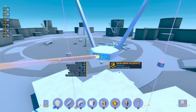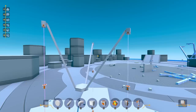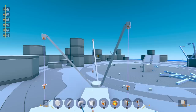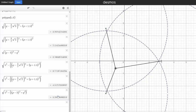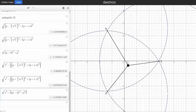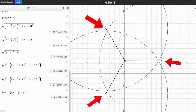Once I saw that working, I knew I was ready to add on the other arms, and after getting all three attached, I moved each of them up and down in a sine wave pattern. The way I set it up ended up moving the printhead in a circle-like pattern. To actually get the printer to print at a specific coordinate, I was going to need to do some math to convert that XY coordinate into heights for all three arms. I measured the distances the arms were from the center of the printer and placed them on a triangle like this.